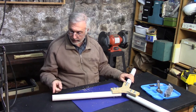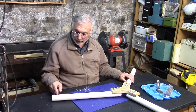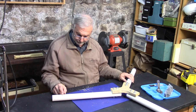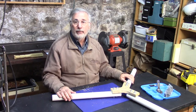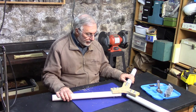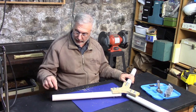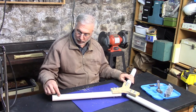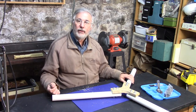And I think I want the wheels outboard of the tripod holes and to make it more stable as it rolls. Now, that might mean I'll need to cinch up the legs of the tripod a tiny bit, but that should be fine. Tripods are designed to be adjustable in that dimension. So that's the next step, setting up and drilling big holes, maybe a 1-inch hole or 3/4-inch hole on the top to hold the tripod legs, and then a small hole on the bottom for the wheel pins.